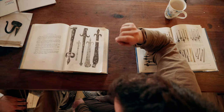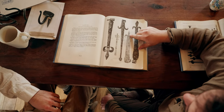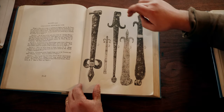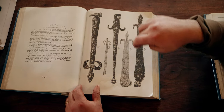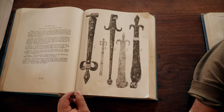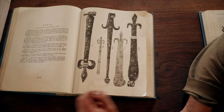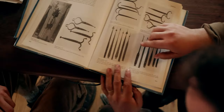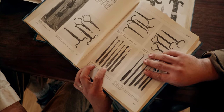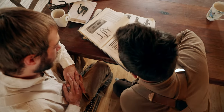So we're gonna do a strap similar to this in shape with a finial closer to a mix of these two. The only difference is these hinges have rolled barrels, and we're going to do a wrapped and forge welded barrel. So the barrel of the hinge will be a little taller, won't be quite as narrow. Obviously not this skinny, but just as far as this end, that's what I'm thinking. Where you let the metal flare out beyond the barrel.